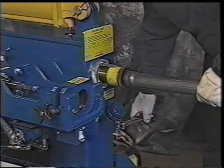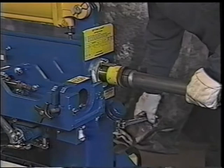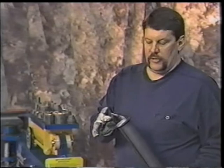There's teeth on there that actually hook that 45 up, and you get that straight on board there. Again, adjust it a little bit, turn it some, adjust your tubing a little bit, turn it some. It'll make a nice, even 45-degree flare for your installation of your gasket and the sealing surface. There's also another way to do this flare, and that will be on the solid segments. We'll do that next.